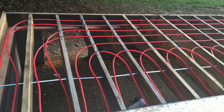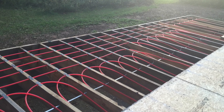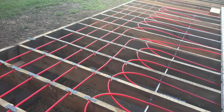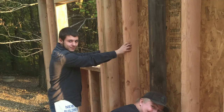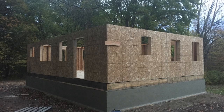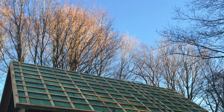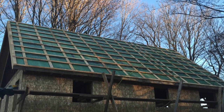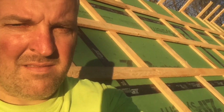Here's the tubing — how I laid the radiant tubing in there. It worked really good. I put the tubing in before I put the plywood down, just hung it off those bridging straps. Here's Big Biscuit framing walls — he wasn't so big then. Here are the walls framed up after the foundation was done. And here's how I did the roof — it's a ventilated roof. There's a picture of me on the roof. It's all strapped.